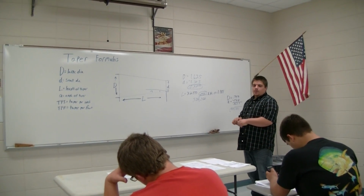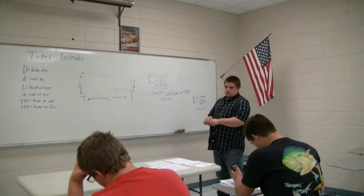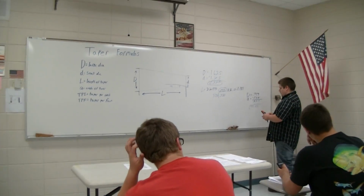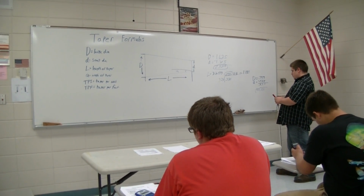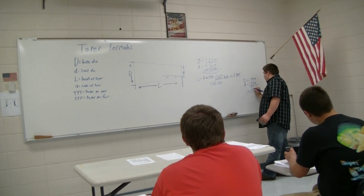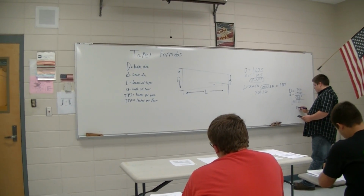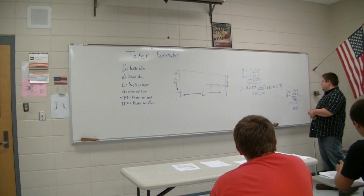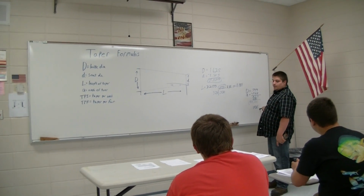As soon as y'all get the taper per inch or the taper per foot, let me know. All right, you got it? Tell me what you got and I'll check it. Taper per inch is 0.119. Taper per foot is 1.428. 0.119? Yes, that's right. So this is going to be 0.119. Then you're going to multiply that number by 12. You got 1.428. It depends on how many decimal places you want. So that's going to be your taper per inch and your taper per foot for the second.